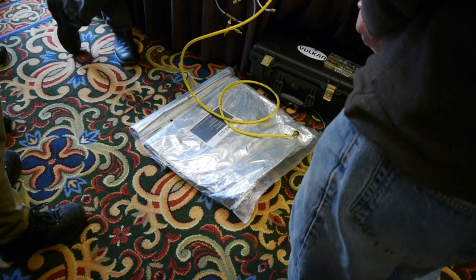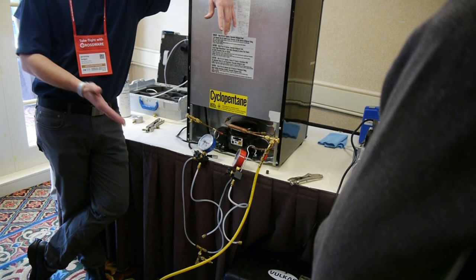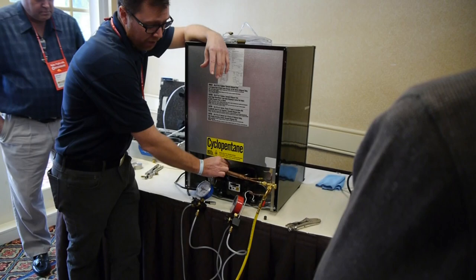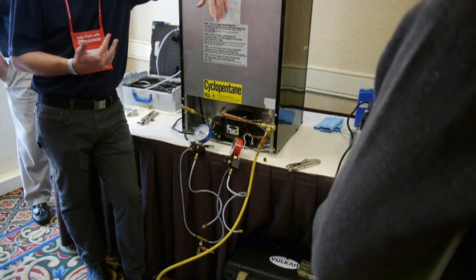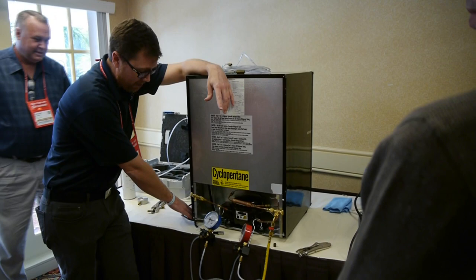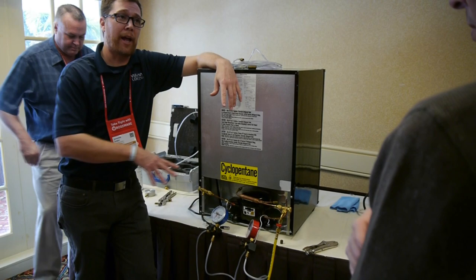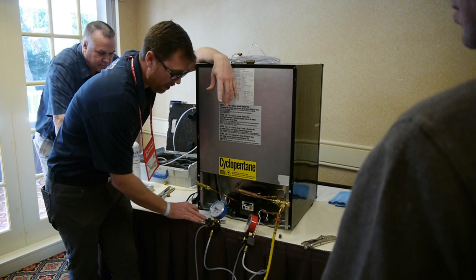There's nothing in the way of noise yet, and that's why I like the bags. A lot of people I train enjoy using the recovery bag because it's audible. Where the suction-side gauge is optional, I can constantly monitor and actually hear the discharge. Once I don't hear anything anymore — especially if I haven't crimped the capillary tube — I just isolate pressure for a bit, let it circulate, let system pressure build back up, and then you'll constantly hear it. The detector is now in its calibration process — the constant tone lets you know it's on and monitoring the environment.